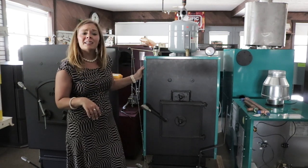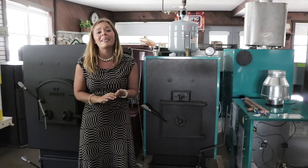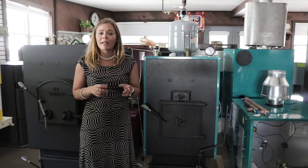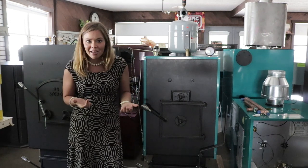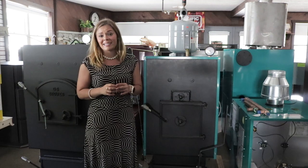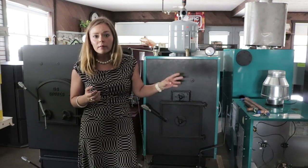These are going to be labeled and sold as coal boilers. Now prior to 2015 they were sold as a wood coal combo boiler. We did have changes in EPA regulations that took effect in 2016. Those regulations state that any boiler that is rated to burn wood must meet these new EPA standards. Now that EPA testing cost is very, very expensive, and also once you get a unit EPA tested for wood it cannot burn coal. The reason for this is because coal is an EPA exempt category. So a lot of boiler manufacturers that were producing multi-fuel wood coal units have opted to just take wood off of their label, because that alleviates the need for that EPA testing since coal is exempt.